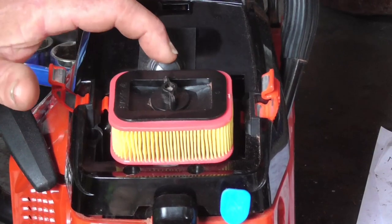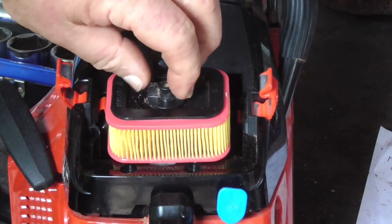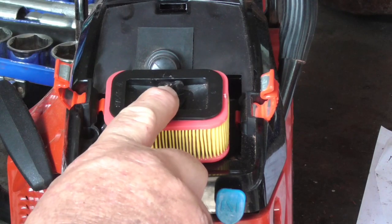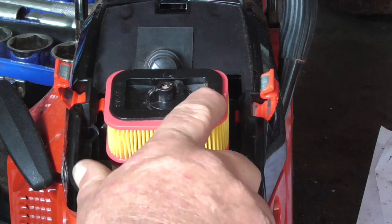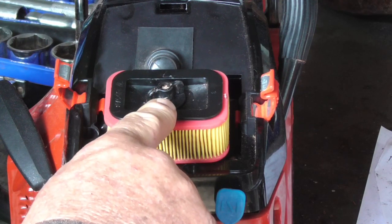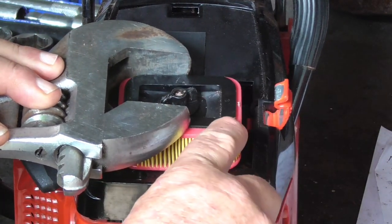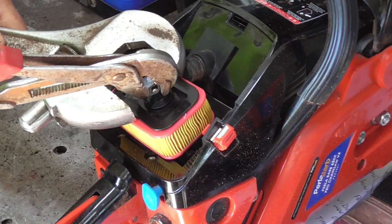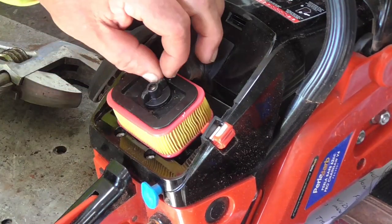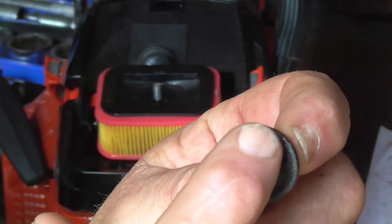This is inside the cap where the spark plug is, and this is the air filter. Originally this nut — I couldn't get it off, but obviously I can now. This is a common thing with them apparently; someone else has mentioned to me they had trouble. What seems to happen is the plastic that the wing nut is made out of and the plastic that this retaining piece is made out of seem to stick together between the saw being manufactured and it getting to you. What I did was get a really big shifting spanner and fit it onto the retaining piece, then get my multi-grips on the wing nut and turn it, and once I was able to turn it a bit it was okay. I put a little bit of grease on that surface just to make sure it didn't stick again.